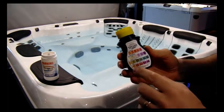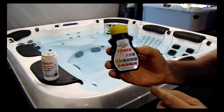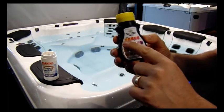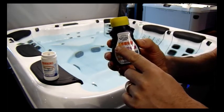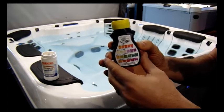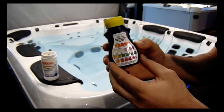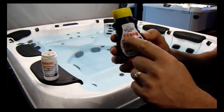Now we're going to make sure our pH level is correct. It's really important that the pH is correct. If we leave pH low on the chart, you can see it's more of an orangey, lighter colour — that's acidic water. Acidic water is going to etch away at the metals and plastics within the pool. It'll give you a tingling feeling on your skin — you might think it's the chlorine doing it, but it's actually the pH being very low. It literally is not good for your pool to be low in pH.